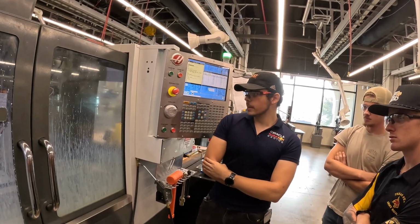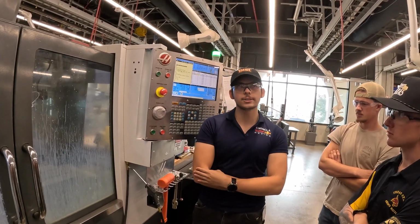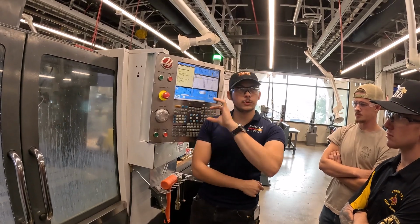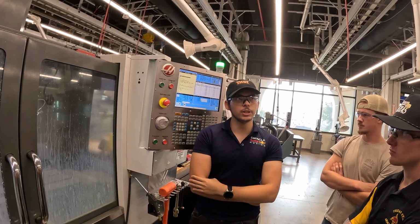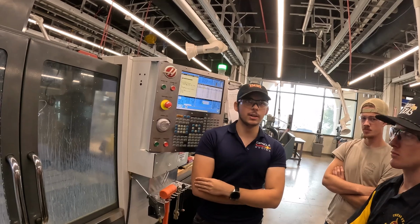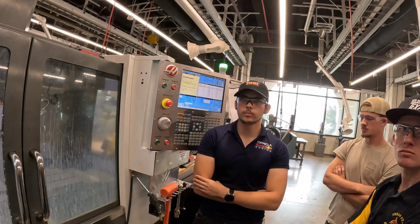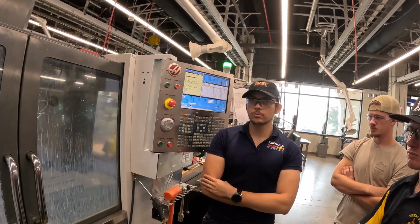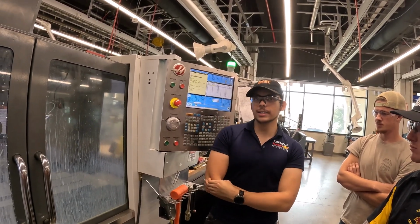If you look up the recommended feed and speed for this tool, it's probably about 15,000 RPM, but these machines just cannot go that high, so go to the highest RPM you can and adjust your feed to that. It probably wants to run at double the RPM and double the feed. We can't do that, so I'm going to run it at the max RPM and half the feed. If the code says 10,000 RPM, it doesn't error out, it just maxes it. Mastercam will let you do 50,000, so that's going to stop at 8. That's a problem if you're wanting it to be a lot higher.